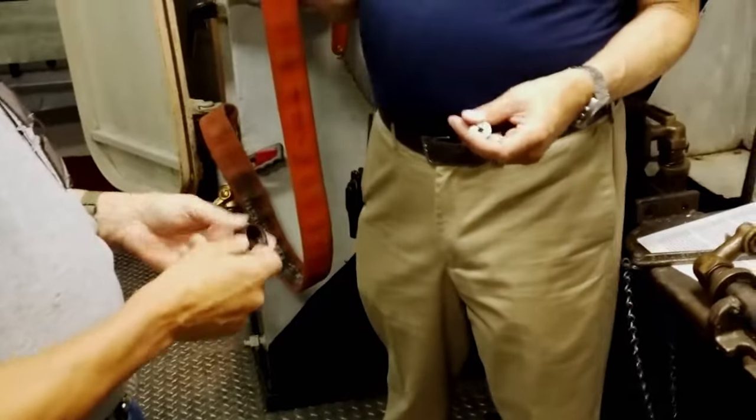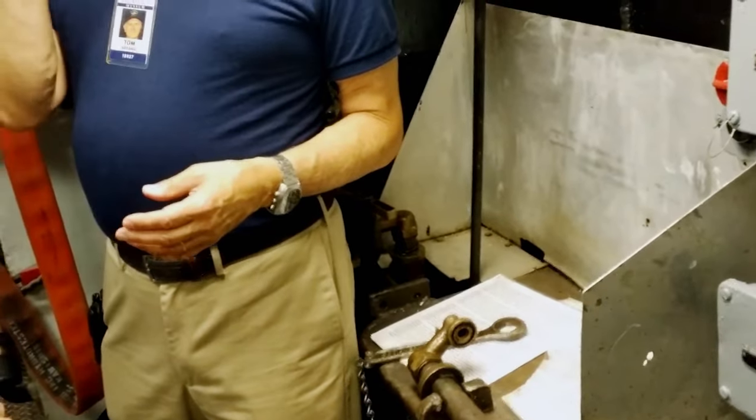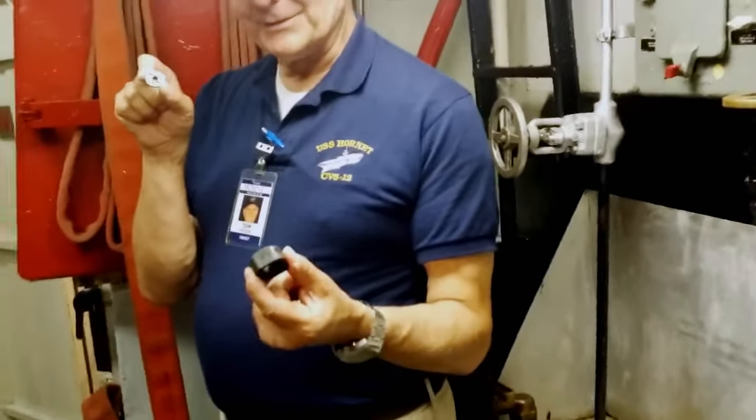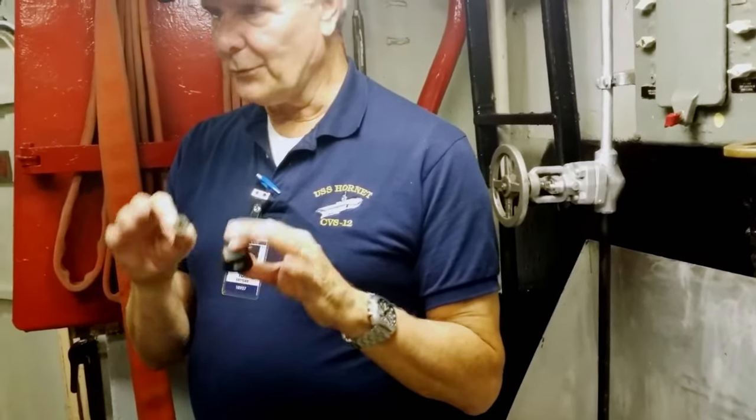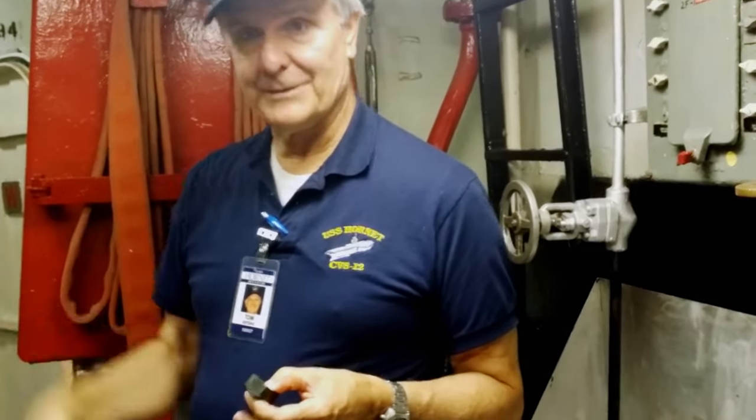On the other side here, you can see how they used to light the burner — they would have oil on it. Beyond the 33-knot rating of the ship, the chief engineer had a set of nozzles that could literally be put in there — high-capacity nozzles. So if you really had to haul and go maybe 34, 35, or 36 knots, you could put certain inserts in that would allow the sprayer plates to make these things go beyond their spec speed. These are mechanical tips.